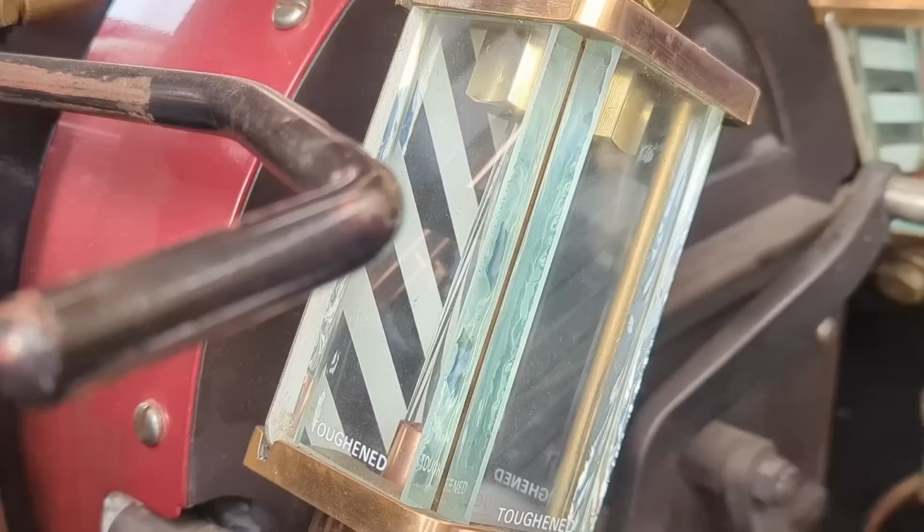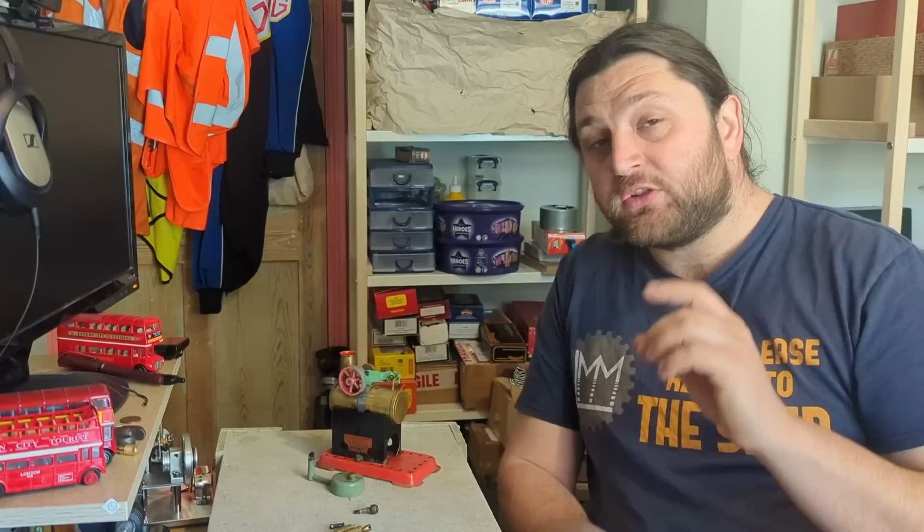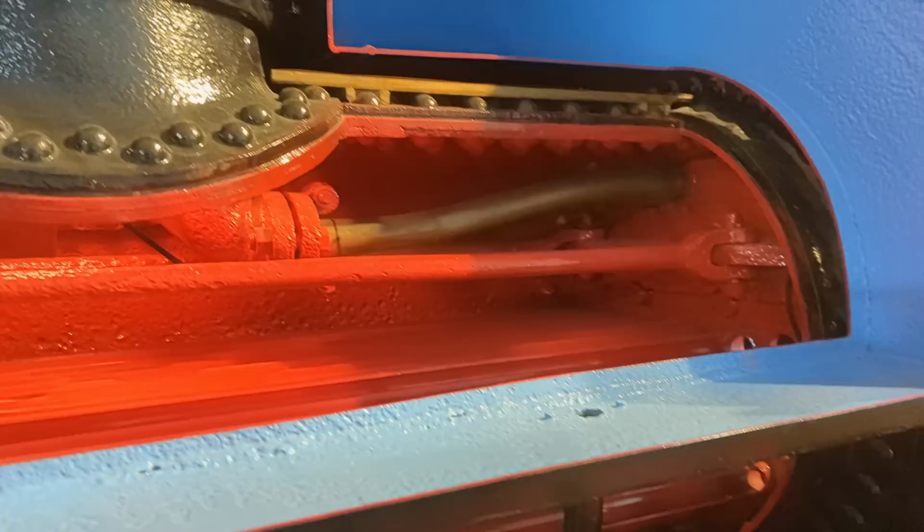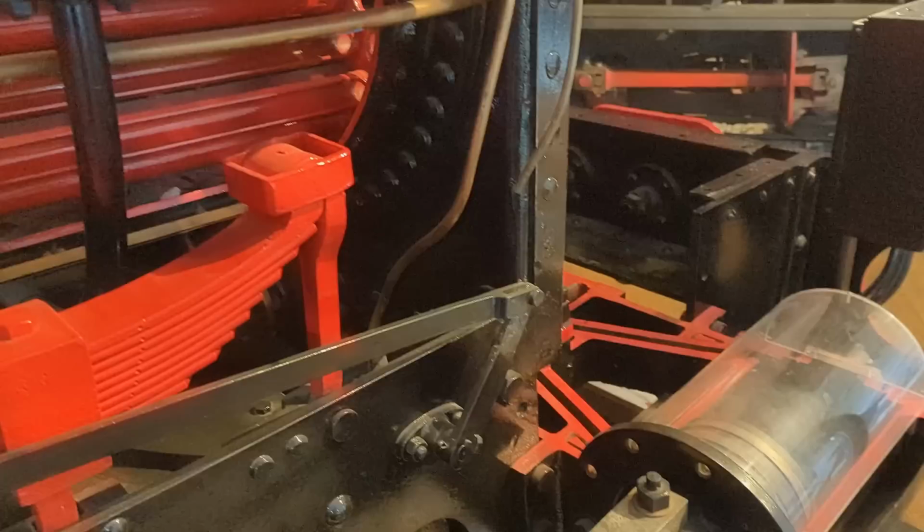On a proper steam engine, when we talk about the water inside the gauge frame, we're only talking about a tiny fraction of the water that's actually inside the boiler. So when that gauge is low or near empty, that means it's low towards the top of the firebox crown. There is still a huge amount of water and thus steam generating potential inside that boiler.